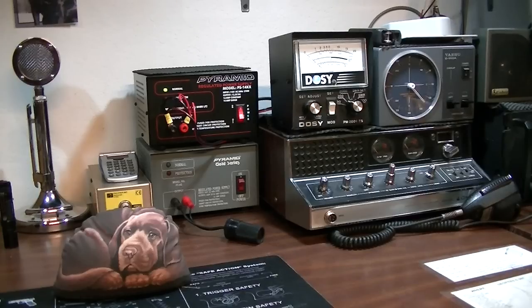The advantage of an export radio is that out of the box they have more features and more power. Many already have variable power on them, variable from 2 watts to 10 or 12 watts on your dead key. They can also be peaked and tuned to perform quite a bit better than your standard CB radio. However, if the radio does not have an FCC sticker on it — meaning it meets all FCC regulations for operation on US airwaves — that matters legally.